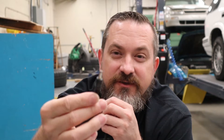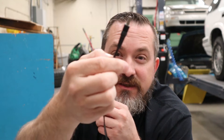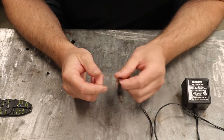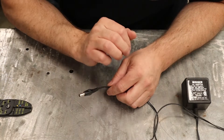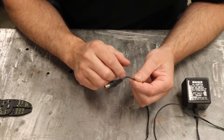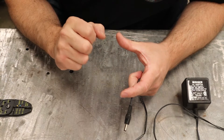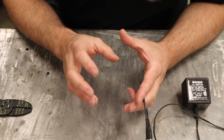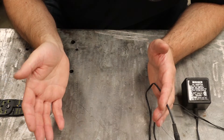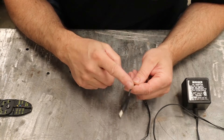At the end it's got one of those push-in connectors, but essentially it's just two wires — all you have to do is clip it, strip back the wires, and make whatever connections you need. This AC-DC adapter is probably the one I'll end up using inside my control panel, since I only need a little power for the fans and it doesn't need to be too big or bulky. I'm going to connect it to a little pulse width modulated computer board where the wires come in for positive and negative voltage, so I can do temperature control — when the inside gets too hot the fans kick on, cool it down, then slow down or shut off to keep the noise down.